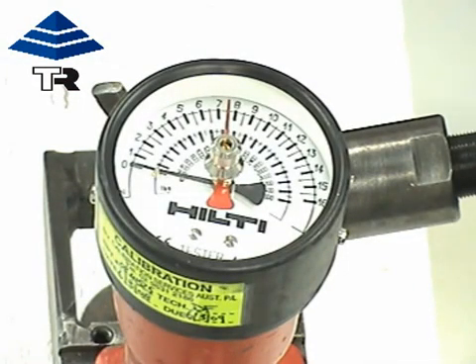The load on the safe ring has now been sustained for two minutes at 7.5kN, which means the safe ring is in full compliance with Australian standard 1891.4-2000 industrial fall arrest systems and devices.